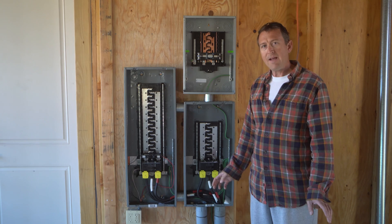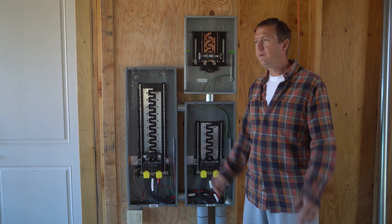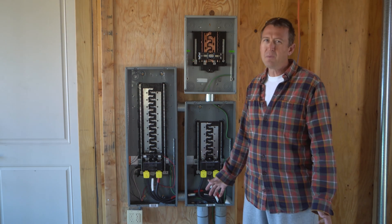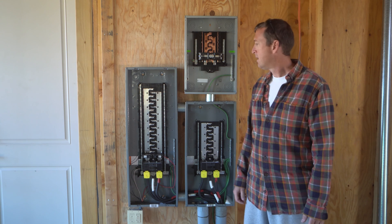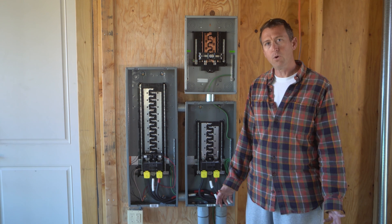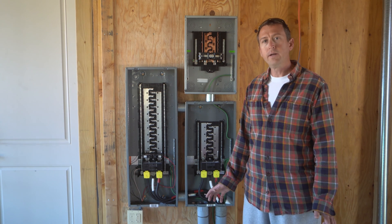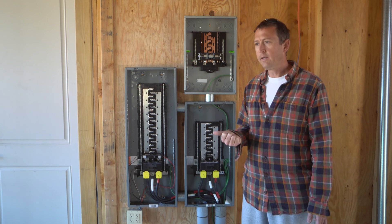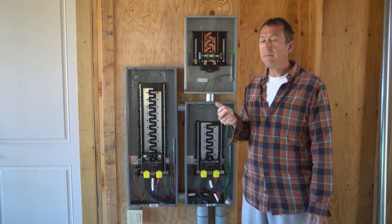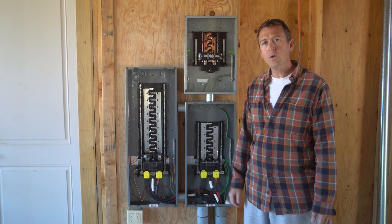That's a lot of info. Let's dive into even more details with some questions from our fans. First question: 'Hey Justin, why do you feel like you need so much power beyond the standard 200 amp residential service? It's a pretty small house.' Well, anymore the amount of power you need doesn't scale so much with the size of the house because of LED lighting and so forth — it has more to do with the number of electrical appliances. In our case, we're actually trying to go almost all electric: we're going to have an electric HVAC system, electric primary water heater, electric oven and stove top, someday maybe an electric car, and an electric hot tub. All of that stuff adds up and we want to be future-proofed.